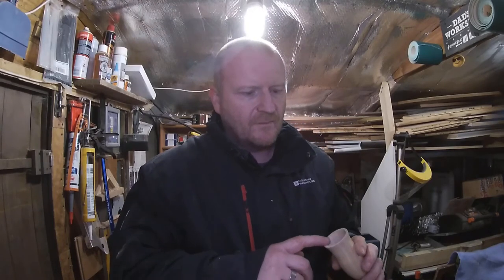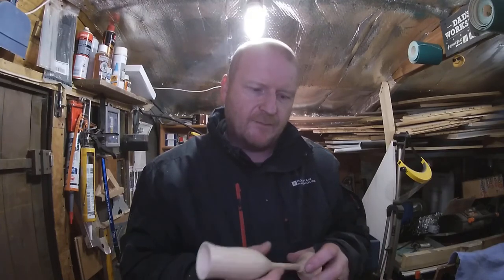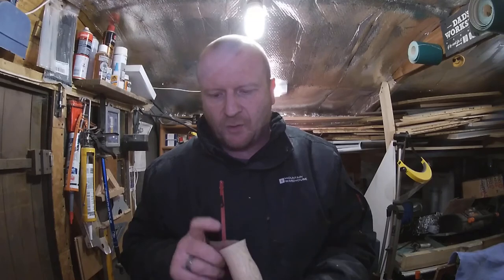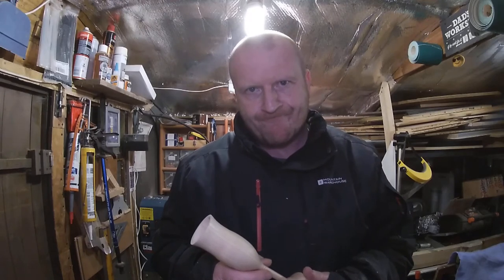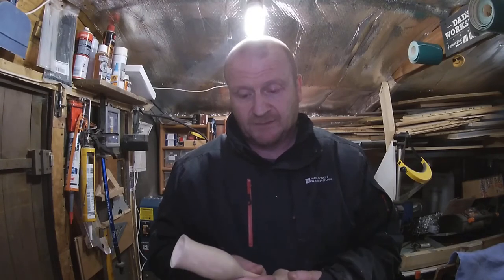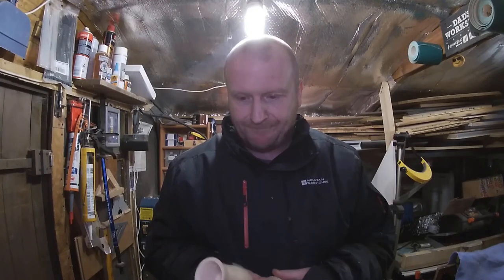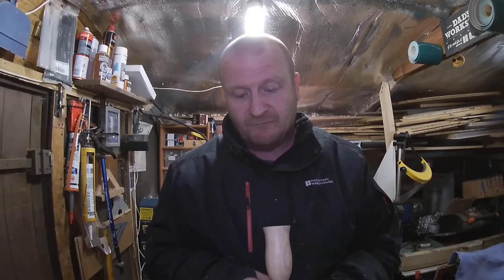I should have shaped inside the goblet first and then trimmed this down, because that was too weak to put in the chuck and support the pressure from the chisels. I'm sure if there is anybody out there who does wood turning that has the misfortune of coming across my channel and watching me really get it wrong, they'd probably be sitting there laughing at me. Whether they made the same mistakes or not, I really don't know.